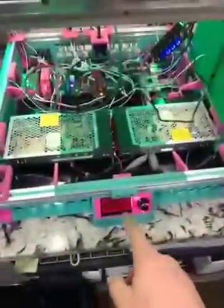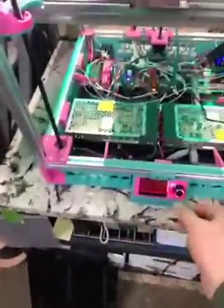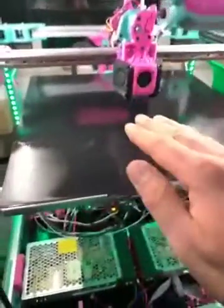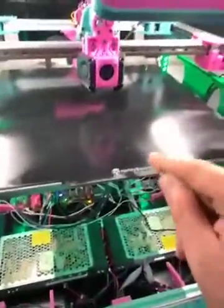You can sit here and adjust using the tuning interface or Klipper — I have an iPad where I adjust the Z offset. You can get your first layer going well. Just keep printing that square and as it's doing that motion, lower or raise it wherever you need to. The glue stick helps too.